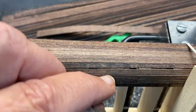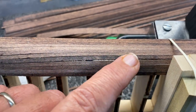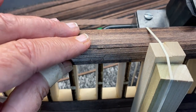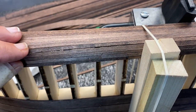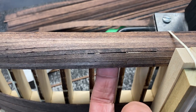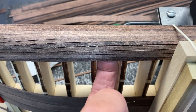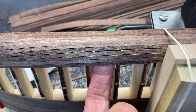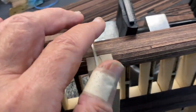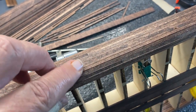I'm very happy with how tight I got these. You can see there's a little gap — you can see through it right now. The instructions say you can fill that with wood putty or something like that. But because I got them nice and close, I don't want to mess up the grain with wood putty. So I'll go from the underside and put putty in, or sometimes I've even used black caulking to fill the gap from the backside, so I can still sand the edges and keep the look of the wood. I don't want it completely flat.